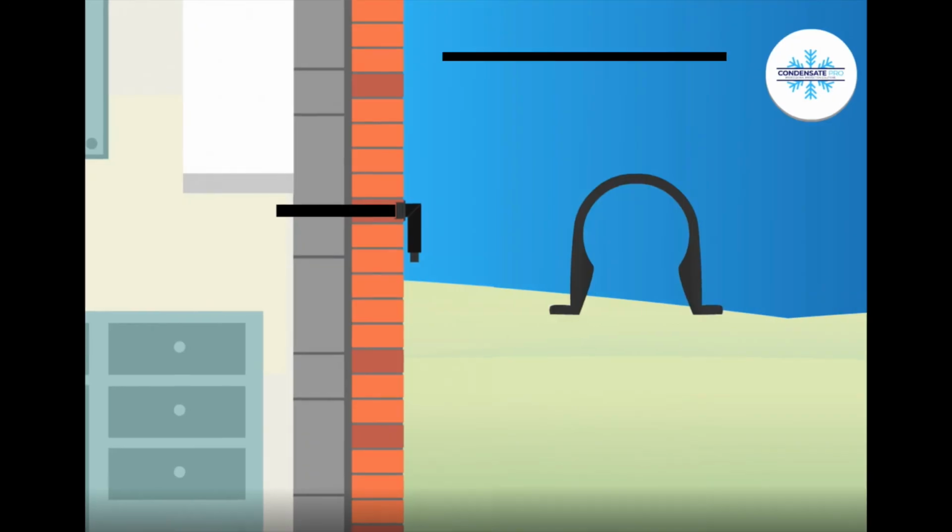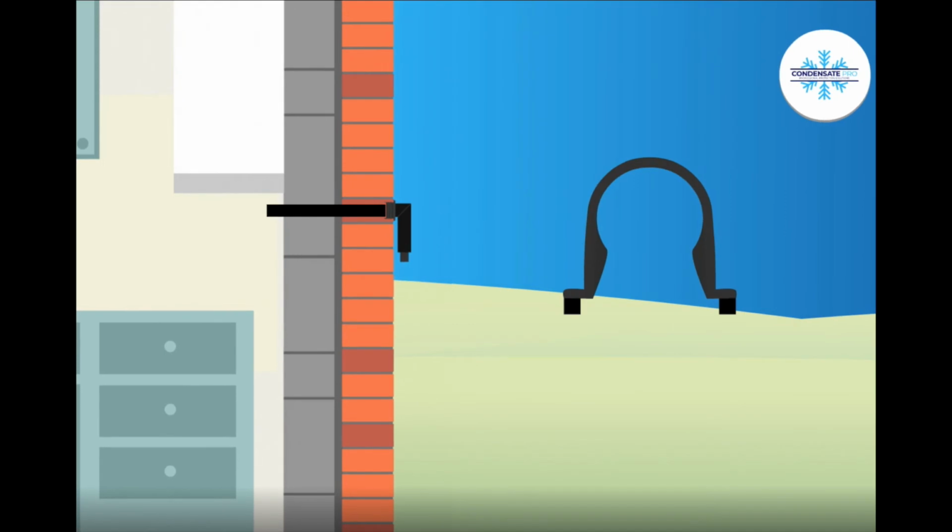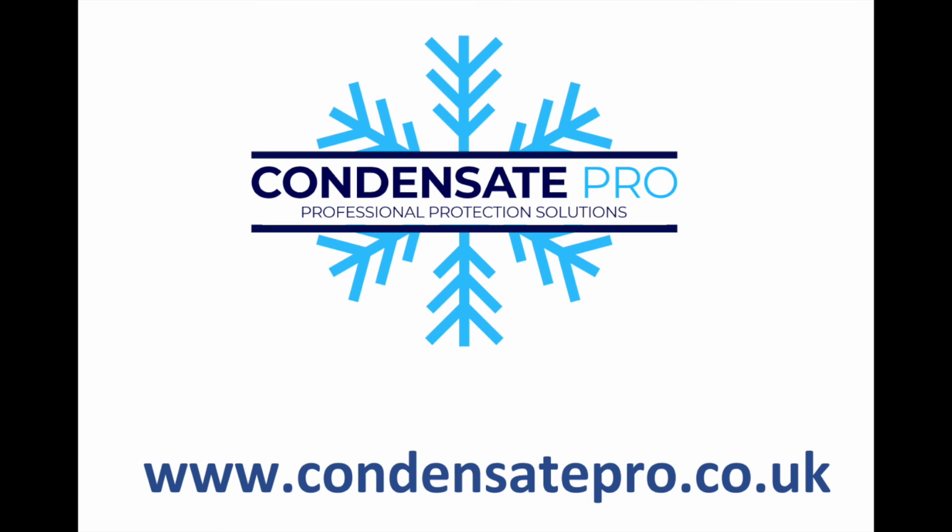Cut the spacer bar down to the desired length, and use to space your clips off the wall. You can use this to go over anything in the way, eliminating using any bends or 45s. Please note: make sure the pipe snug is sealed to the insulation.